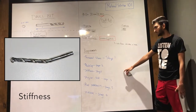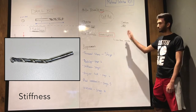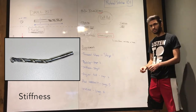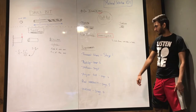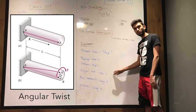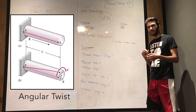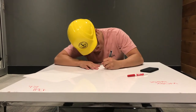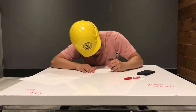You want a high stiffness value for your drill bits because if you are drilling by accident on an angle, you don't want the drill bit to deflect or possibly fracture due to not having a good stiffness value. The angular twist is also important because when you are applying a torque, you don't want the drill bit to twist in a way so that it fractures in the middle — it basically requires the ability to withstand high torque levels.